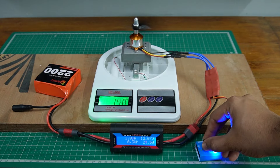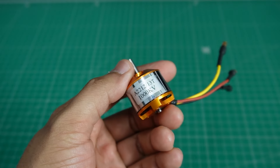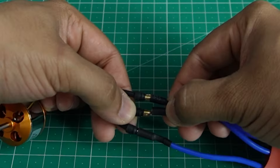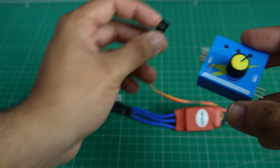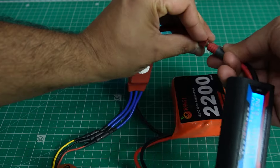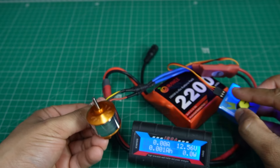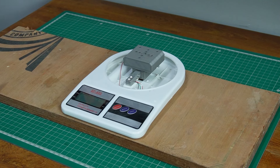To drive these motors you'll need an electronic speed controller, also called an ESC. Connect the three wires from the ESC to the motor. I'm using a servo tester to control the thrust and a 12-volt lithium battery for power. I'll also be using this DC current meter for monitoring the voltage, current, and power consumption of the motor. You can find links to all the parts used in the description below. I'm using the motor thrust tester that I built previously — if you want to see how I made it, you can check out the video linked here.